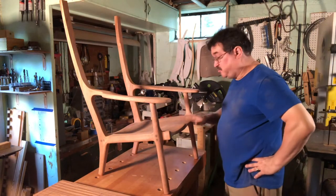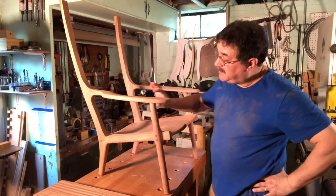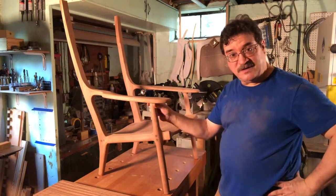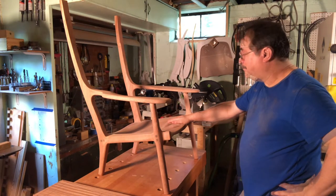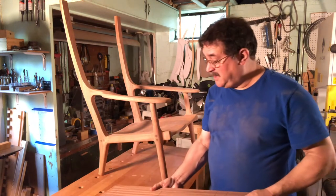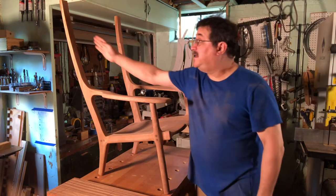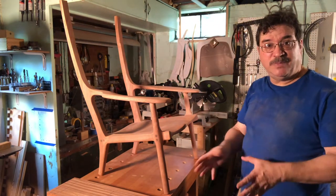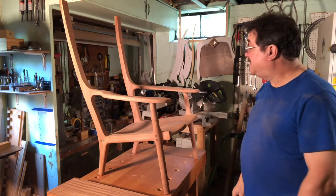It's really looking pretty good now. The arms have been finished — fully shaped with a nice slim profile. They've been attached to the chair with the fair joint where each arm meets the rear post finished, and the fair joint where it attaches to the front leg underneath is also finished. The whole chair has been sanded to a high grit of about 320 and we're ready to move on. This is the wood for the headboard — again starting at one and three-quarter inches thick. I'll cut it to fit and shape the bulk of it off the chair, leaving the ends unfinished to be completed after attachment to ensure a smooth transition between the post and the headboard.